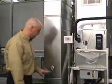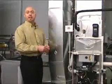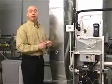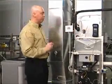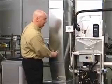Now, since this is a testing facility, I have put a damper in here. What I'm going to do is simulate some shrunken return duct — high resistance in the return duct. I wanted to show you what would happen if I turn this and block some of the air off.